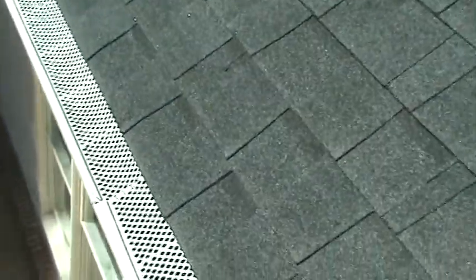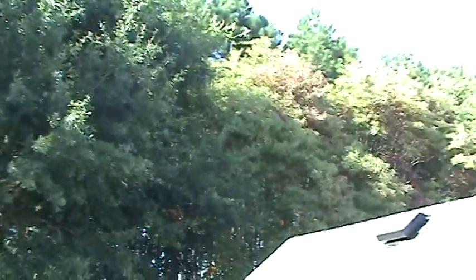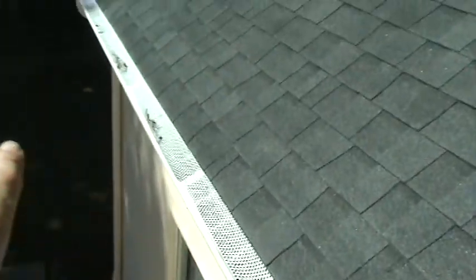The other thing we'll show you real quick, these are just a cheap section of plastic gutter guards, and you can see they look fairly clean on top. The problem this customer is going to have, and this is what no one's telling her about gutter guards, with these leaves, most of the gutter products will work somewhat with these, but the next row in are those pine trees. And you see the pine needle stuck here.